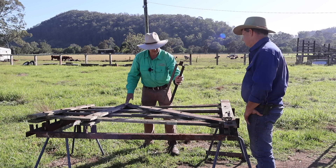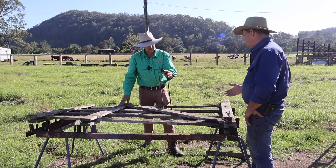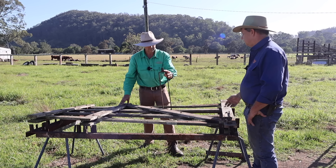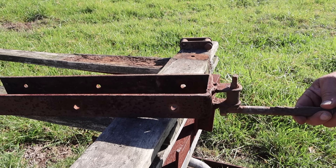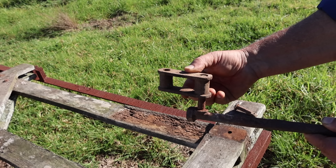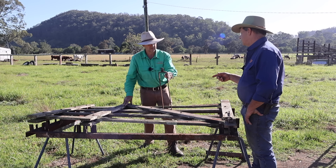You were also utilising scrap and improving on the hinges available at the time. One of the things my dad identified was that a lot of the hinges were only steel on one side of the timber, and over time the bolt would pull through the timber on the other side. So he came up with the idea of building a frame-type setup in steel so the bolt goes through both sides and pulls it all together - so the timber didn't matter, it was all held together. The hinge was just a piece of conveyor chain, cut in half and welded on the back of that steel frame, with the corresponding chain pin used as the pin that goes into the post.